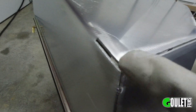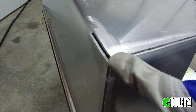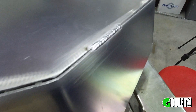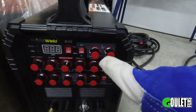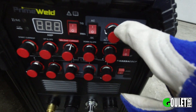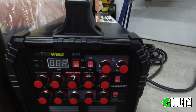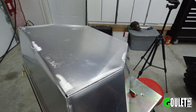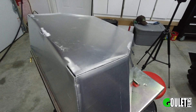Due to some gaps — this is just one pass with the plasma cutter then a bend — there's no way to get this gap any tighter. I do have small gaps, and what I'm finding is that turning down the AC frequency has been helping me here. I went from 120 hertz — which I recommended earlier — down to about 80 hertz. Eighty hertz seems to be working well for these outside joints, whereas when I was doing fillet welds and surface passes on the coupons, 120 seemed to work really well.